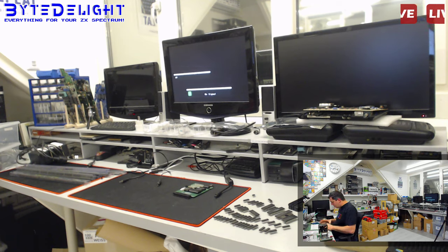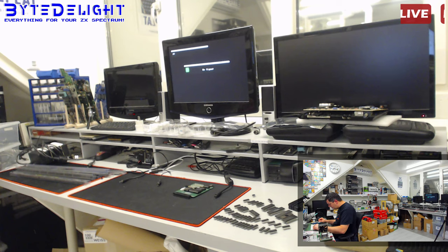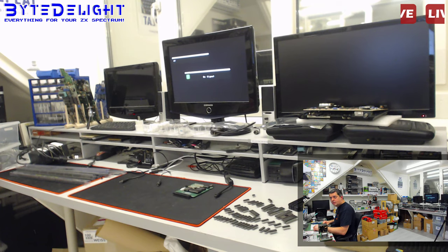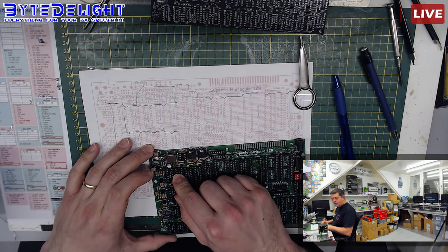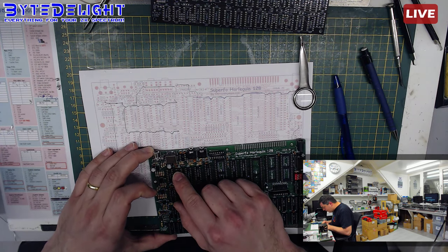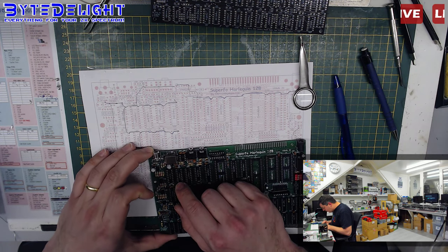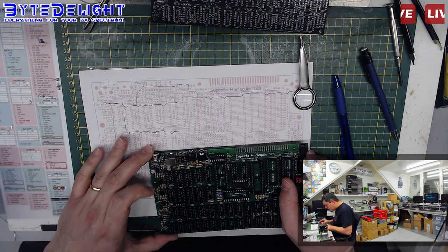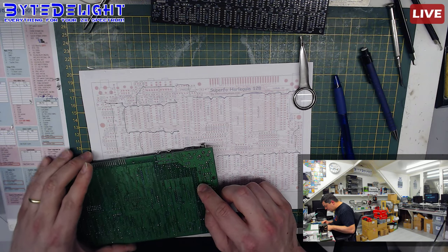So I would say just do another cut. We can do it here, or maybe here, I'm doubting a bit. We can also create a cut here, but it's on the top side and can be a bit hard to fix later on, because we cannot reach those tracks quite easily. Oh, sorry, I forgot the camera again. What would be the best, because we cannot reach this quite easily. It will be a bit hard, but we can do an easy cut there. But maybe it's better to do the cut on these tracks here first.